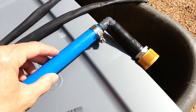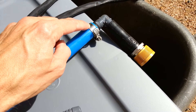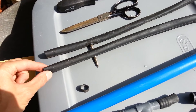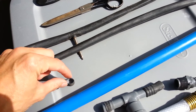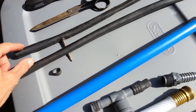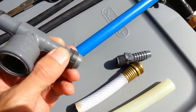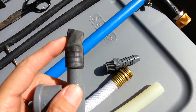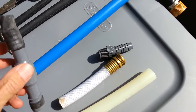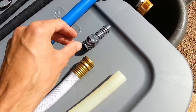If you don't need it under pressure, it's good for solar projects. I'm using a hose clamp and some cheap inner tube — about a $2 inner tube. You cut the inner tube into little rings. The inner tube allows you to put them over the little fittings, and you can cut them long or short. It allows you to connect to all kinds of fittings that are very inexpensive.